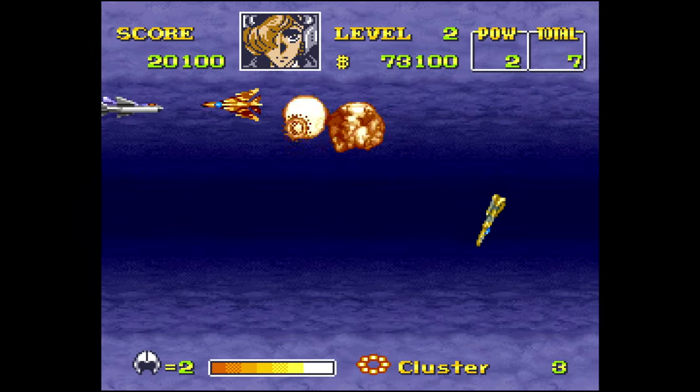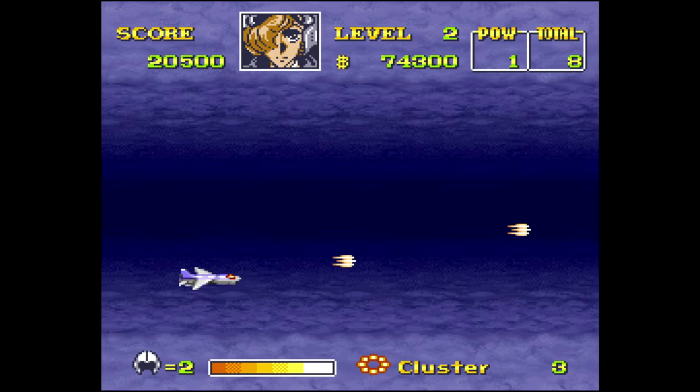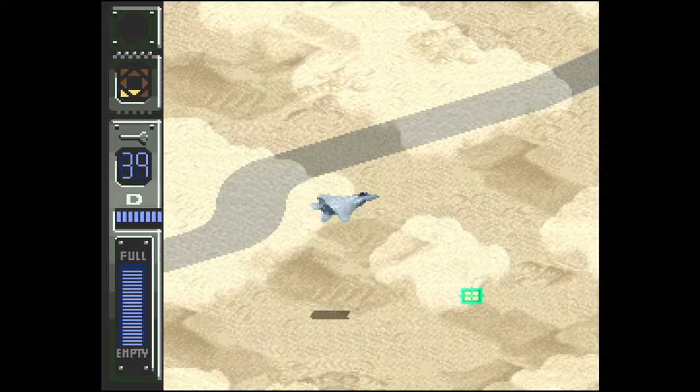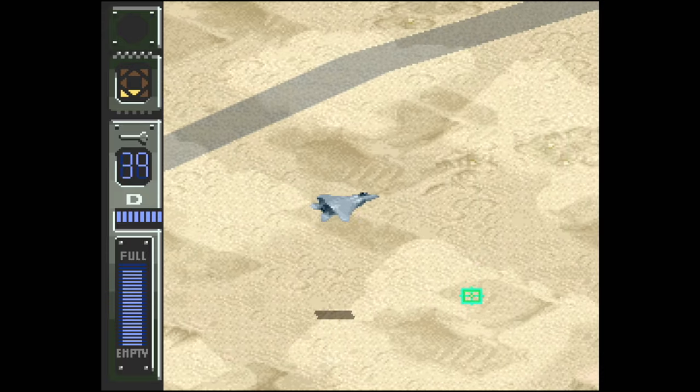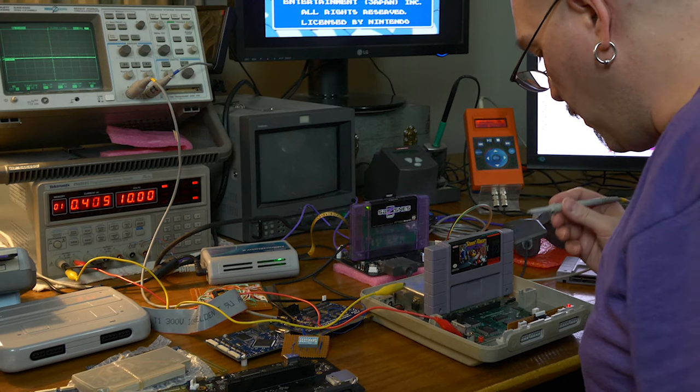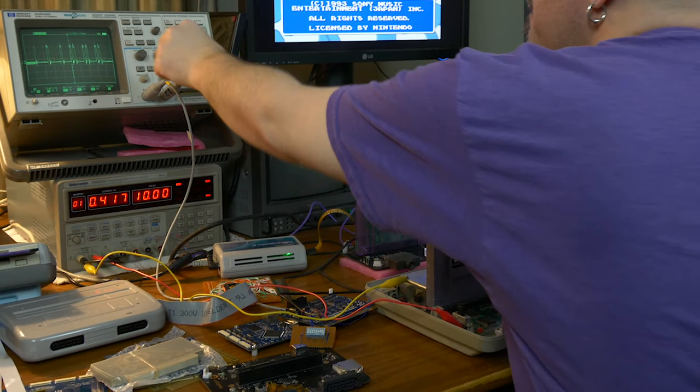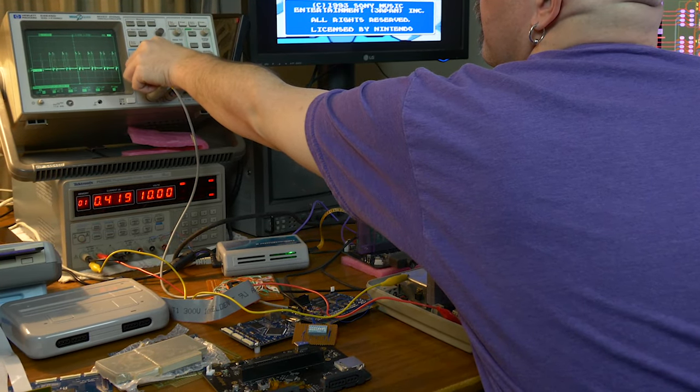The result is a design which can execute instructions in parallel like the Super Nintendo's original integrated circuits, but its accuracy ultimately hinges on the quality of the code. FPGAs are not inherently a miracle solution, but in the right hands, the results are impressive. The key advantage in using an FPGA then lies in its latency, or lack thereof. With no additional overhead, the Super NT can precisely reproduce the behavior of the original Super Nintendo hardware with absolute cycle accuracy. That's not to say cycle accuracy isn't possible in software, mind you.